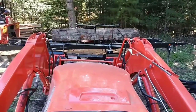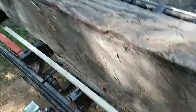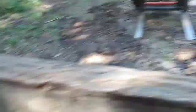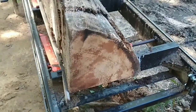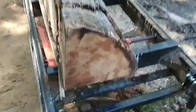We got it loaded. I got this log on here and as you can see it's not a perfectly straight cut along there. I can't have the log arms up to keep it from sliding while I cut because I'm going to be cutting the bottom first, so I just put some wood strips there to keep it in place. I'm going to take a couple of cuts off the bottom, then flip the log and take a couple of cuts off that bottom. That's why quarter-sawn wood, while it is a superior product, is considerably more expensive — because it's a lot more work than just slapping a log up there and cutting straight through.